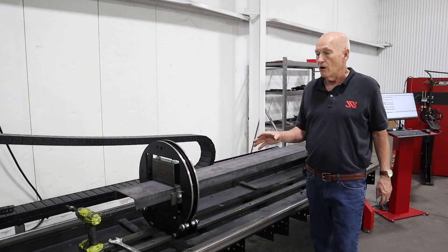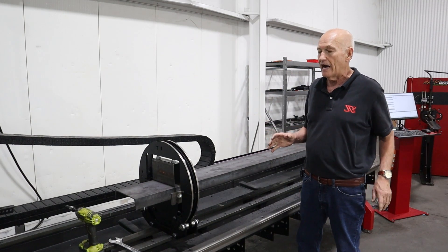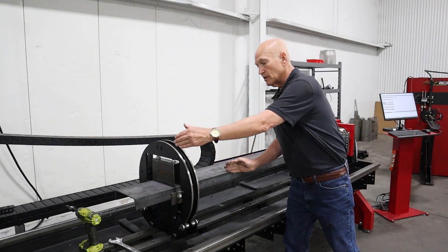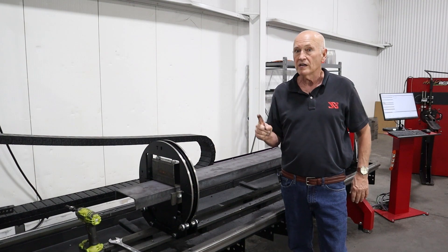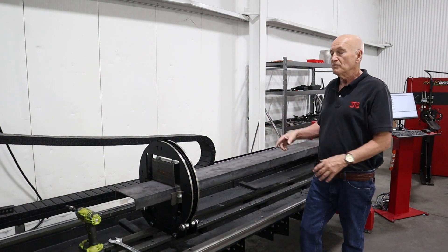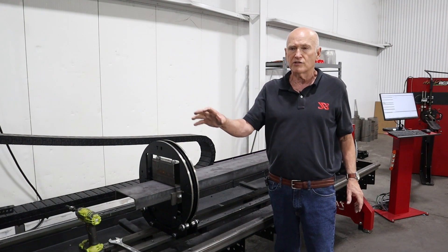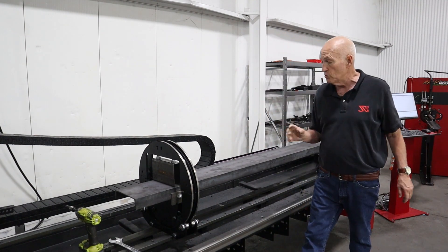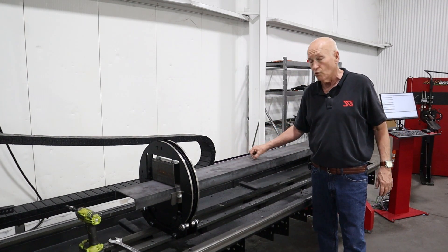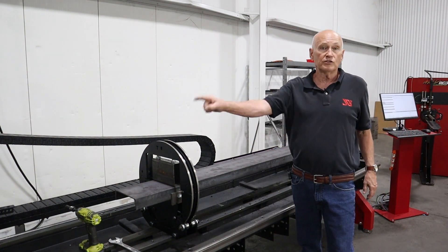The ring adapter system works extremely well on longer pieces — say stringers for stairs, things like that. If you're doing a lot of short pieces, it's not so good. You can only run one ring adapter in the machine at a time, because these things are not precision — if you put two in the machine they're basically going to fight each other, wobble and clank. For shorter parts, in our software you're going to tab it — say you don't want the part to drop — so you leave a little tab here, one in the middle, then after you cut your piece you take it out and cut the tabs to get your shorter pieces.